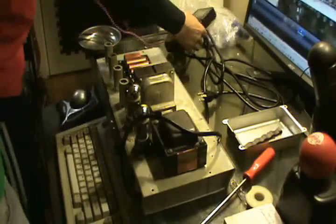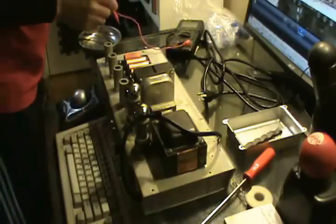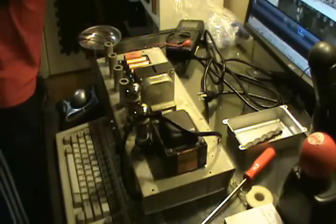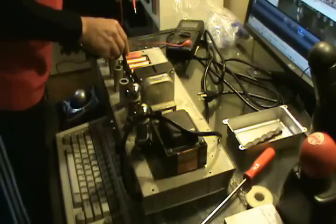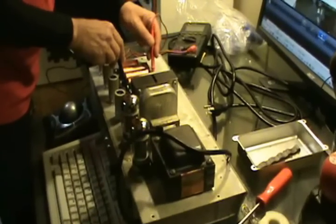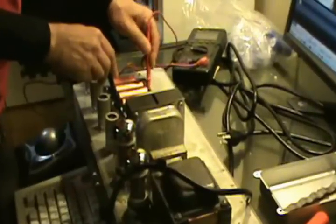Once the capacitors are exposed, you'll want to check for voltage present across them. Test each cap independently. If the power supply is properly loaded and everything in the amp is functioning, there should be a reading of approximately 0 volts. However, I have seen cases where tube amps, having been stored for 20 or 30 years, have still had substantial voltage present on the filter caps. This is a 525 volt power supply, and it is a shock hazard, so be careful.